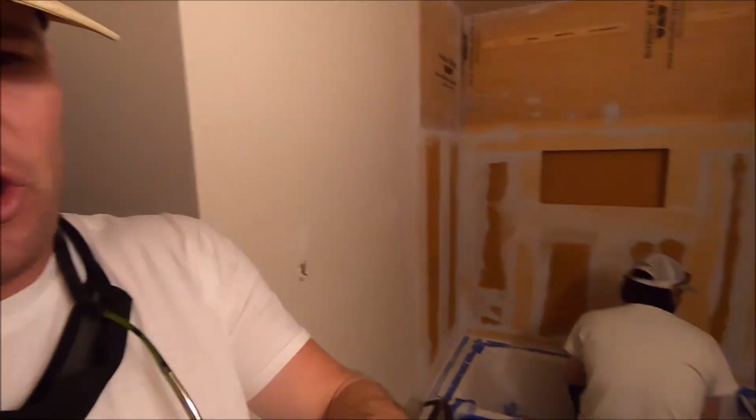Bright and early. Day three, the fun begins. All the prep is done. Tile installation is obviously our favorite part of bath and shower remodeling projects. Shower's prepped, waterproof, 4-inch cans in, vent fans in, angle stops are done, valve is plumbed, everything is ready. Let's show you quickly. So the shower's ready for tile.